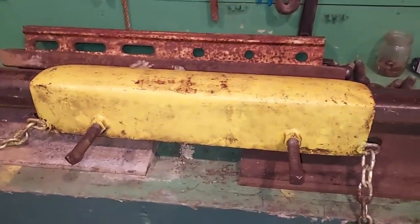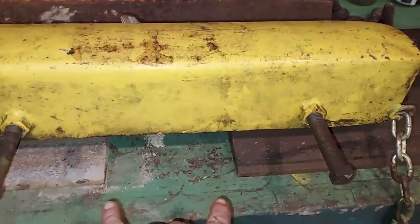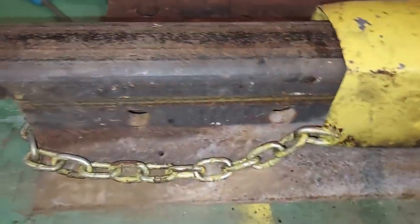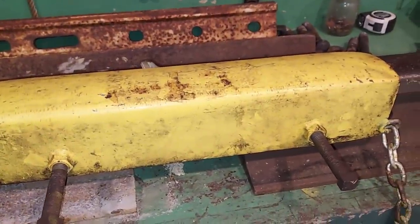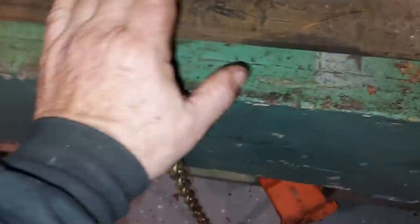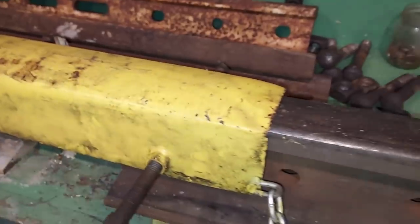This is called a rail splint — some people call it a rail bridge. It's not really designed for as big a gap as I've got set up here in the shop; it's more designed for when your rail head cracks or you have a chip out of it, to put over there and get a train over it on slow order. I'll put a link in the description to Alden so you can see a brand new one of these. These chains here wrap underneath around the tie — there are supposed to be hooks over here, but they've broken off on mine. I've actually never had to use this, which is why it still has paint on it — I've had it probably 17 or 18 years.